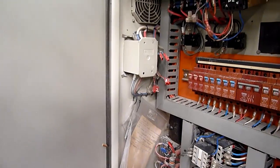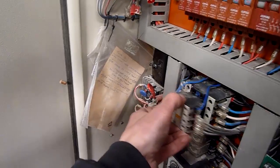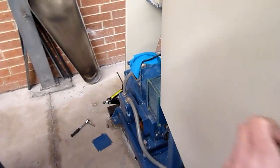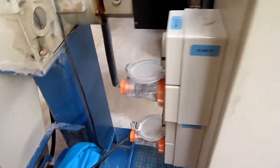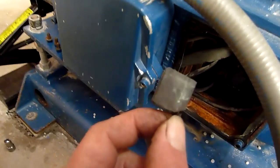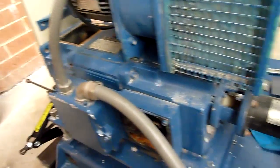I was off work yesterday. I heard they tried to start it, but it wasn't starting, so we'll see how we go. It's had a blow heater in here for three days straight, so when they tried to start it, the motor tried to kick over but couldn't. The brushes were frozen in the holders from oxide — obviously the water reacts with everything and they start to get stuck, and sure enough, all four were stuck. So I'm going to clean and polish all of them up and see how we go.